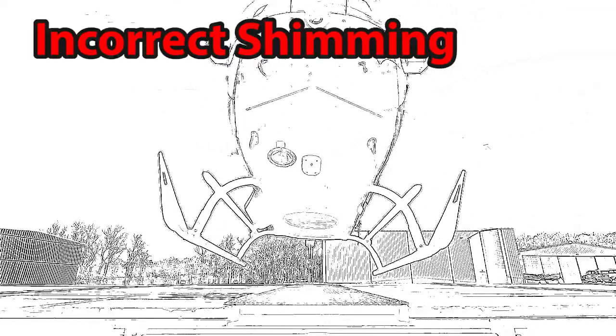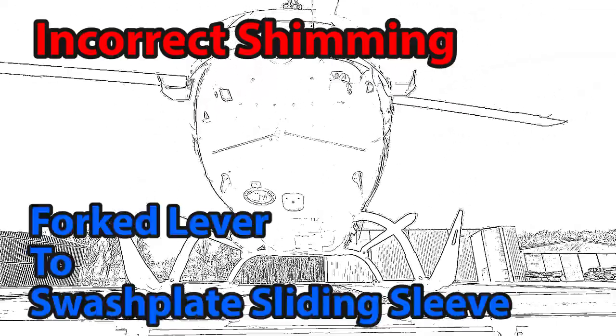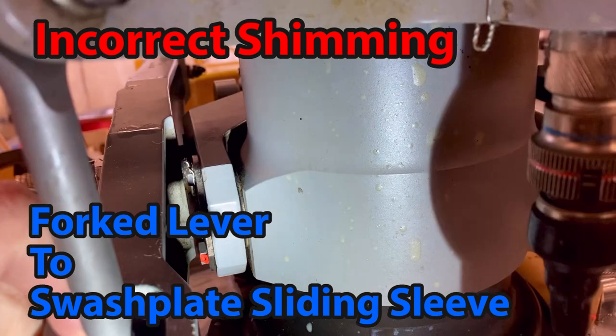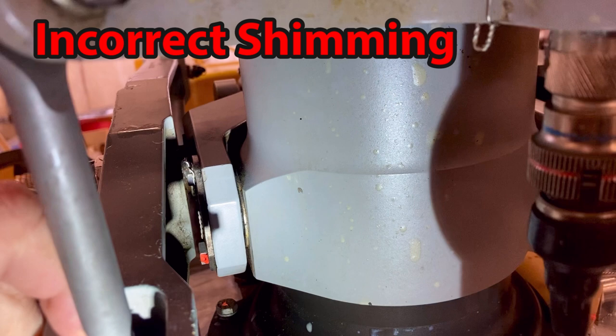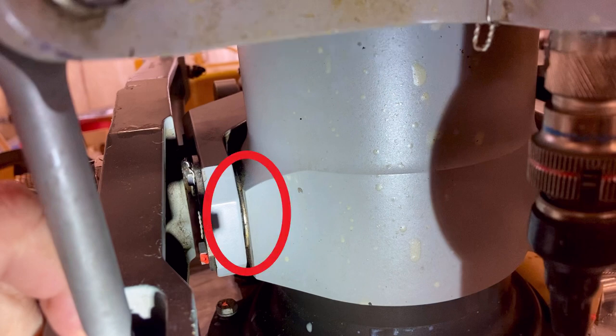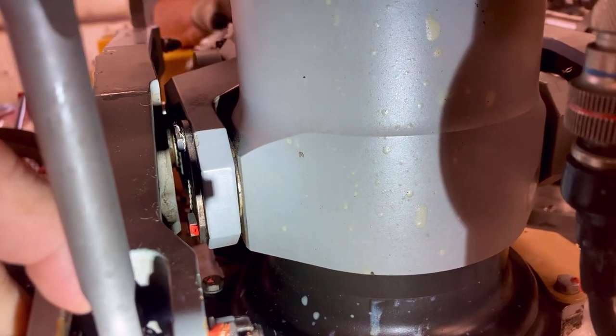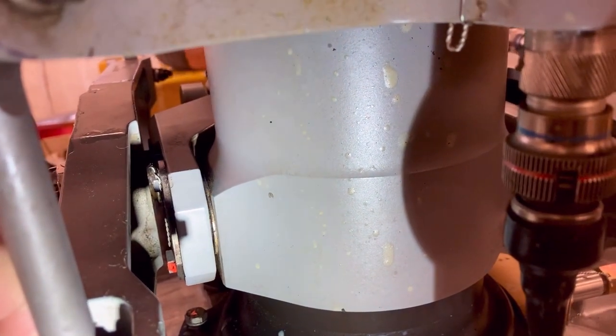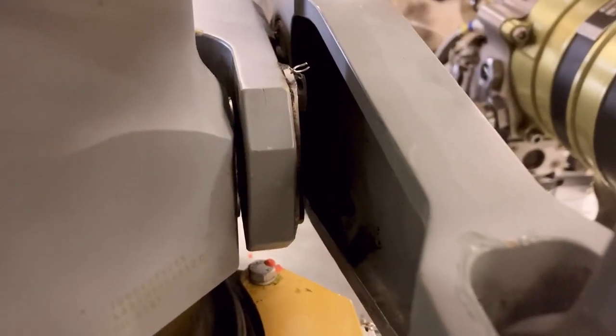Welcome back. Today we're going to talk about the shimming between the fork lever and the swashplate sliding sleeve — also called the collective lever sometimes. I've found this wrong more than once on other aircraft. You can see the loose play: if you grab the front of the fork lever or the cyclic levers on the side and move them side to side, you'll see some play — and the bearing block has tons of play as well.